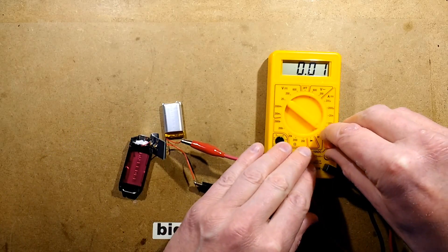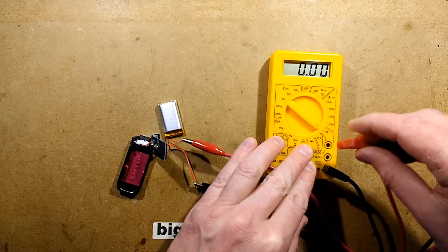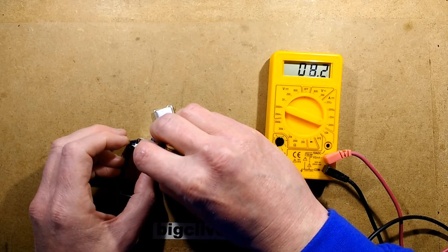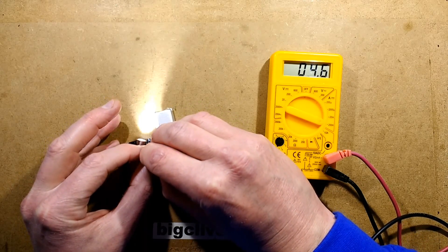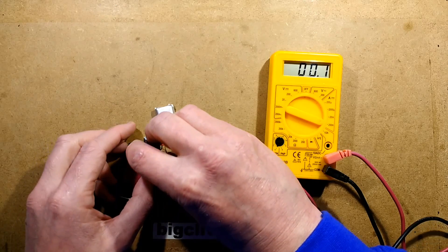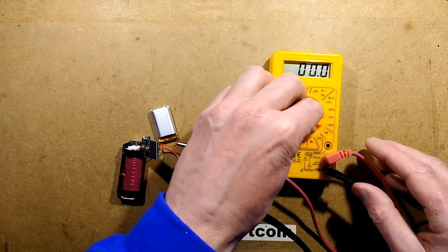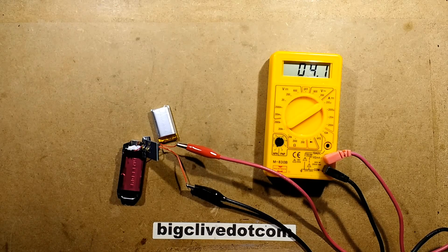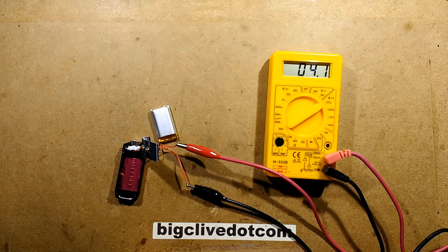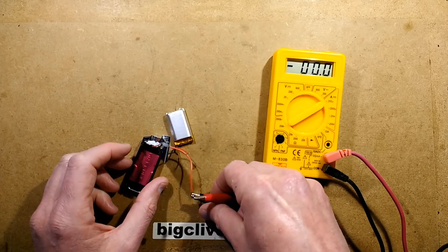Putting it back to a lower setting and activating lock-out mode — it flashes once to confirm it's locked. The quiescent current when it's in locked-out mode with the buttons disabled is four microamps again. I wonder if that's a software issue they've already addressed and resolved — it might have been that in an earlier firmware the processor kept running and was drawing a steady few milliamps even when locked.